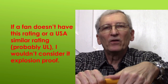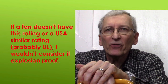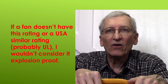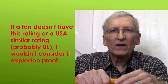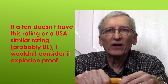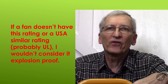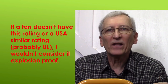My bottom line message is that if you buy a fan and it doesn't have this rating plate on it, it's not explosion proof — I wouldn't trust it. Check with the manufacturer. I'm not an expert, I'm just telling you what I'm reading. Go back to the manufacturer and find out. In my case, I'm not using this in a professional body shop — I'm not subject to OSHA. This is for my personal use. It meets an explosion proof standard, so I was comfortable using it to paint parts for my car. If you need to go beyond that, the next level would be to look at UL certifications — they're one of the main listing organizations in the U.S. My warning would be: if you find a fan that looks like this, read the rating plate. If it isn't certified to this or an equivalent U.S. UL standard, I'd be very careful about it. I hope that answers the question — that's all for now, thank you.